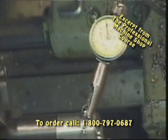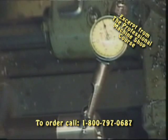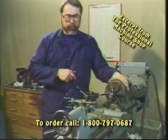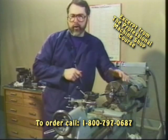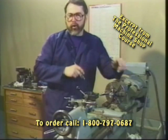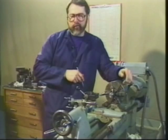Now we've dialed that part in within about two ten-thousandths of an inch. If we turn the machine on and very gently bring it up to speed, we can see we've got about two ten-thousandths of runout on the part, which is close enough for most machine work you're likely to encounter. You can see the versatility of the six-jaw, though you can't dial it in as much as you can the four-jaw — you're only dealing with a runout of approximately fifteen to twenty thousandths that you're able to pull back into concentricity with your lathe spindle. If you've got to dial in more than that, by all means use the four-jaw.